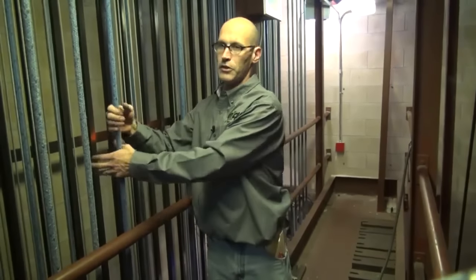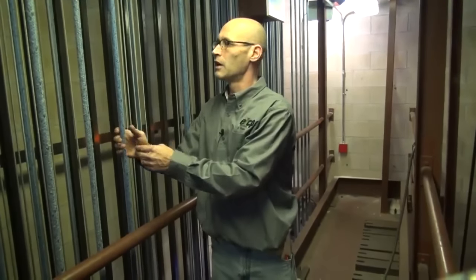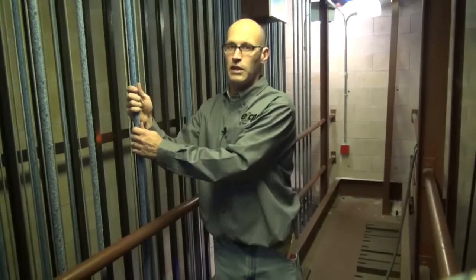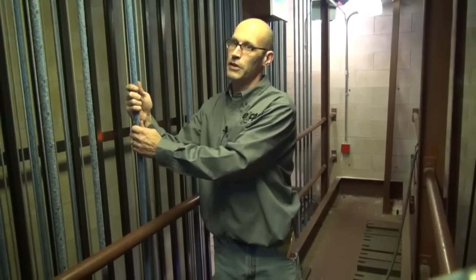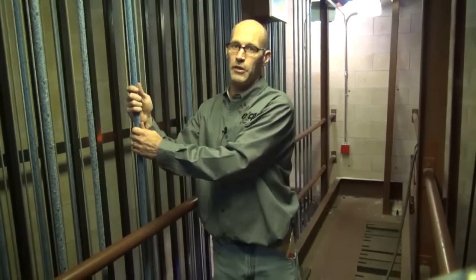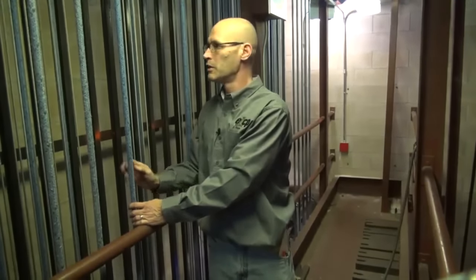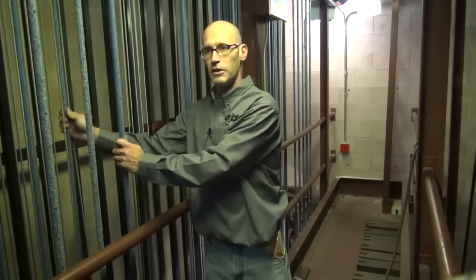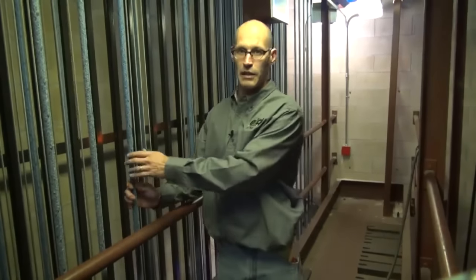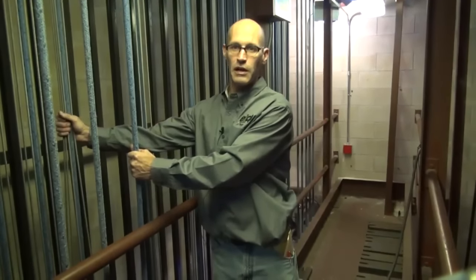It's very difficult to resist grabbing a runaway rope to stop it — people will injure their hands. If the load is 300 pounds and you weigh less, the odds are it's going to fly you up. When you open the lock at the locking rail, check the rope first for tension, look at what's on the arbor and what's on the batten, and communicate with your coworkers so that everyone stays safe.